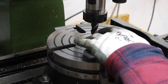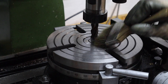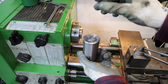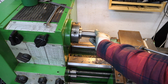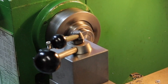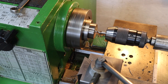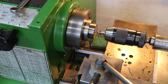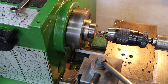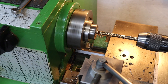With the taper now flushed to the table I can move back to the lathe for the next operations. Confident that the Morse Taper 5 attachment will run the part concentric, I start by facing off this part to make sure it's perpendicular with the ways. After that I start the drilling procedure — I eventually want an M6 thread going fairly deep into the part. Starting with a centre drill and opening up with progressively larger drill bits, I achieve the 5mm hole needed deep into the part, which I'll tap out to M6.